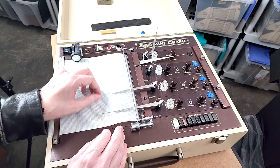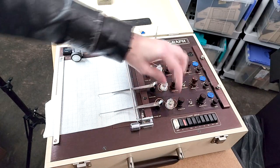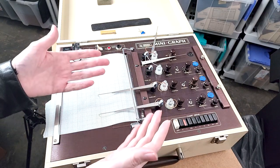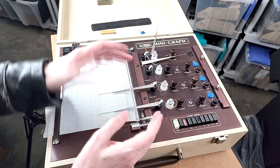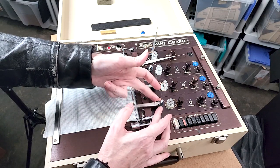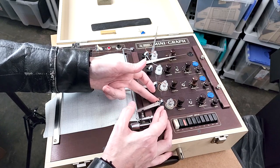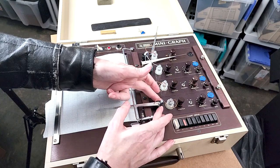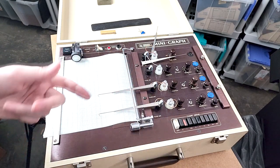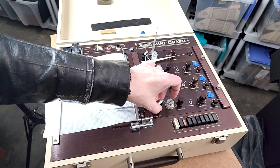It doesn't actually make contact. These pivots — I thought this would have a really light feel, like a voltmeter or an ammeter, with a very featherweight hairspring. But that's not it; these actually have a lot of resistance. You'd have to have a really strong field there to get that to move, which is I guess why they need powerful amplifiers to amplify the signal to be able to move that.